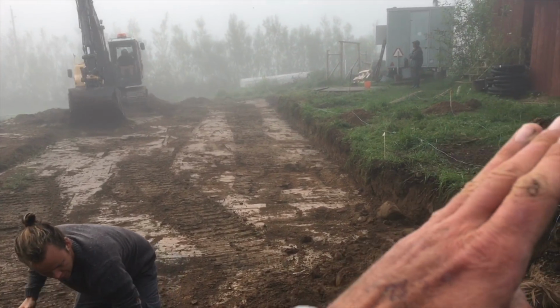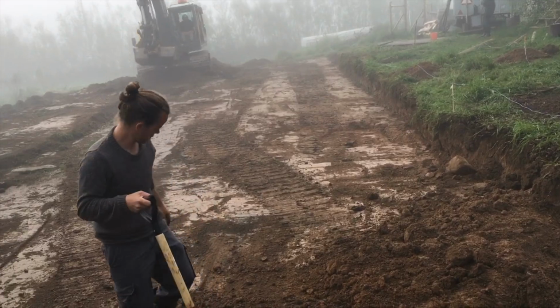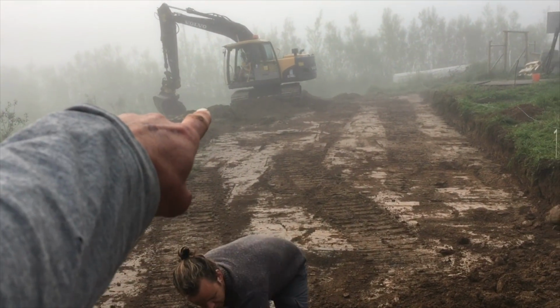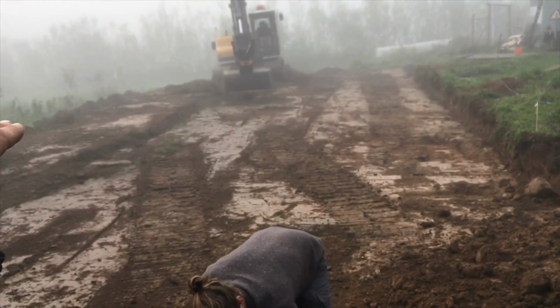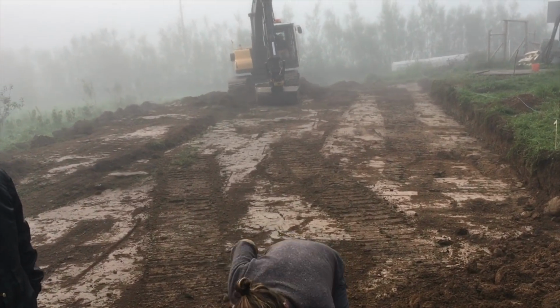We're going to shave this edge off, put the drainage along the line that's cut now, and we should have enough soil to level the whole thing off. We had a 75 centimetre low point over there, lower than this point, and about 60 centimetres here equals the level over there, so it's working out well, not too many rocks.